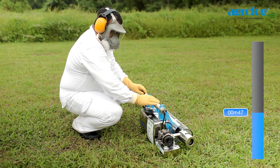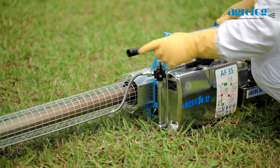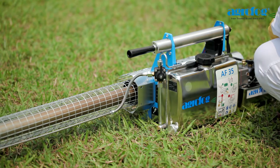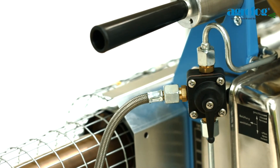It is recommended to warm up the unit for about one to two minutes. During the warm-up process, always keep the solution tap in the closed position. Start fogging by turning the solution tap half-turn counter-clockwise.